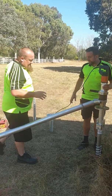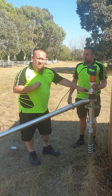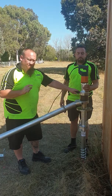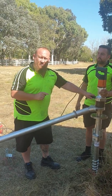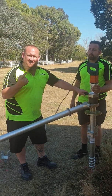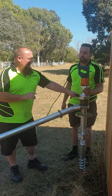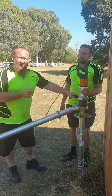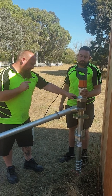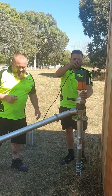Now the important thing when you come to drive the screw in, you want to have the machine set on high. That is until you get through the actual screw. Once the thread is into the ground, you want to stop, make sure the machine has stopped fully, and then you're able to change gears down into that low ratio. That'll give you the torque that is needed to get that Helix ground screw nice and deep. So if you wouldn't mind, Rocky, show us how it's done.